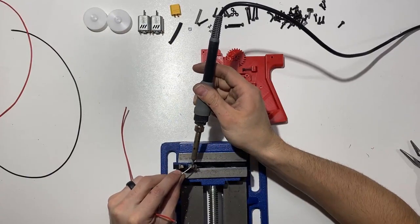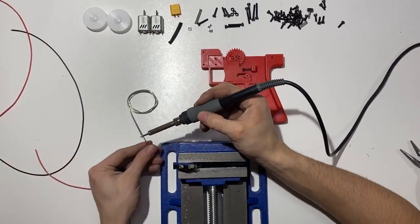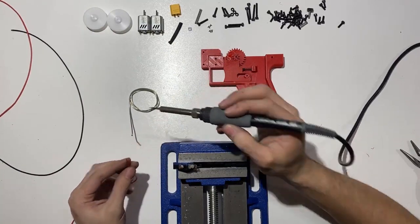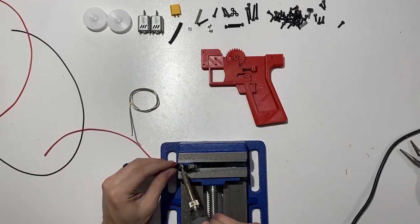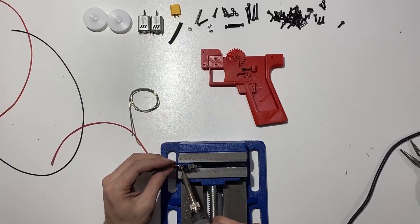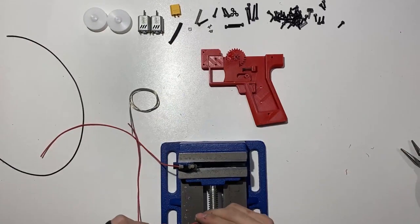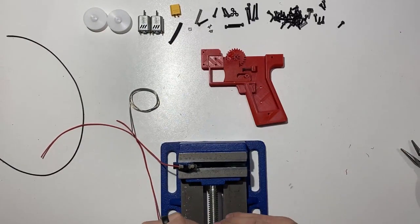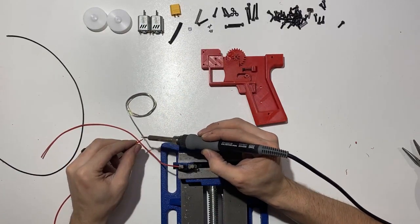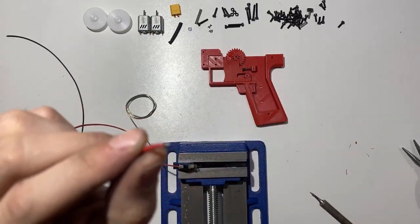Tin the tab, then tin the wire. The shorter wire is going on the side — I want it to go in the direction of the button, going down toward the table, placing it on top of the contact. Then the other red wire goes on the other leg going in the same direction — strip, twist, solder. You want your wire to be fully tinned for a much easier connection.